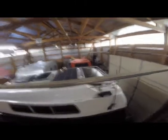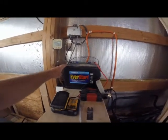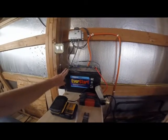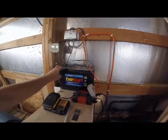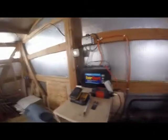When I started out I had a 100-watt panel and your basic Walmart battery, which says it's about 110 amp hours of storage — but that's suspect. It depends on a lot of factors; I found you get about 80–90 amp hours out of it. But it's cheap — about a hundred bucks — and if you replace it within a year you can get it replaced for free. They're not expensive, so they're a good choice when you're starting out.